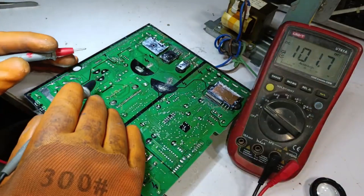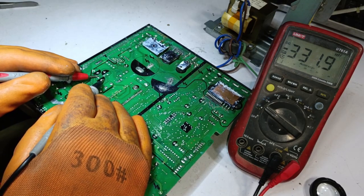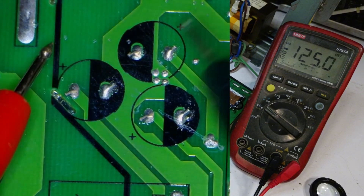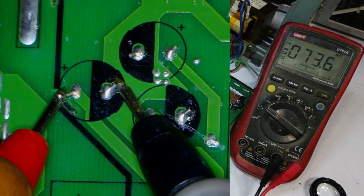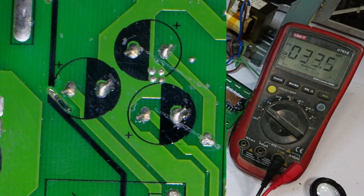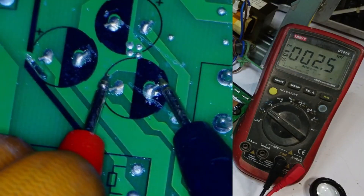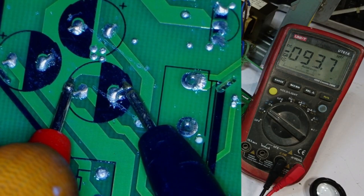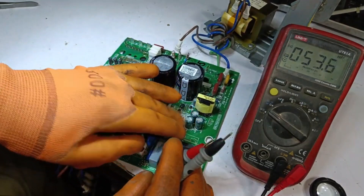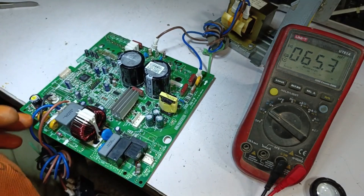I flip the circuit board. Some of the capacitors should show around 5 volts and some around 15 volts. There's some fluctuation happening on one capacitor, but the voltage isn't stable. Checking the second capacitor, 15 volts are being generated, and on another capacitor we are getting 5 volts. However, I feel something is heating up around this point. The voltages on one capacitor aren't proper either — it's supposed to have 8 volts, but I'm not entirely sure. Since 15 volts are being generated, the SMPS is indeed turning on. It seems like some component is getting hot.